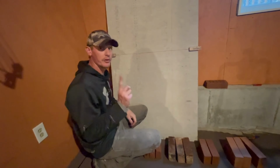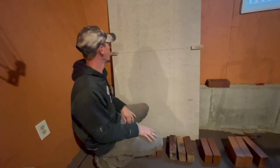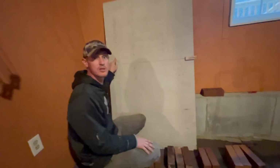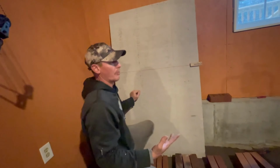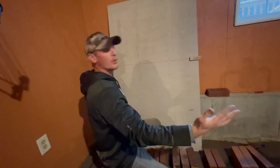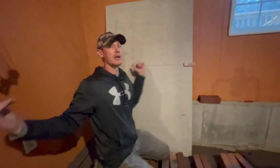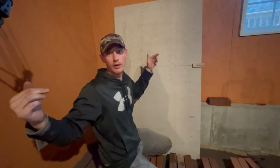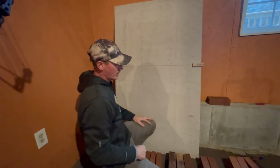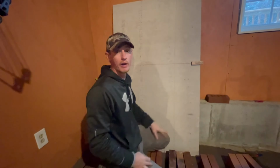One other tip I'm going to say is when you're doing layout with your brick ruler, mark the courses on your brickwork, on each side. So this one job I did, we had a big window in the middle. It was a brick front, and I had a perfect level line across the building, and I measured down from my height to that level line where I was going. And I marked it all out right up to where that window was, and we started the brickwork off the brick foundation, off the concrete foundation.